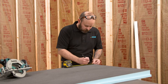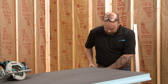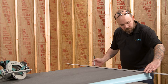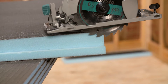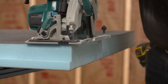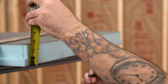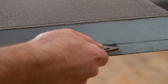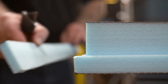On the modified edge of the extension module, a rabbet channel will have to be re-notched to receive the curb. Working from the top of the extension module, mark one half inch from the perimeter on the modified side and draw a line from end to end. Set the depth of your circular saw one inch above the bottom of the base — this is important as a curb will later wrap around this corner. Run a depth cut from end to end of the shower base, carefully following your line. Measure up from the bottom one inch on either side and make a mark. Using a straight edge, mark a line — it is very important to keep the channel level and consistent. Use a sharp utility blade and in a few passes, cut through until the depth cut and the side cut meet. Use your utility knife to fix any imperfection in this channel.